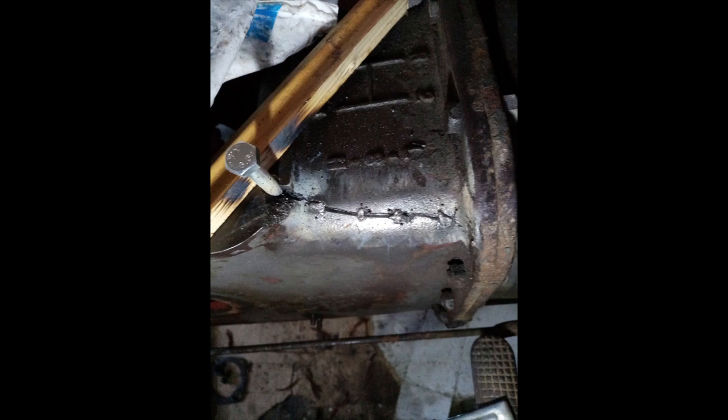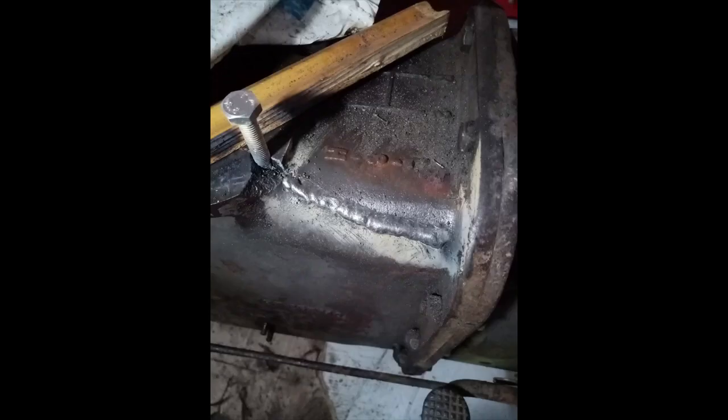But yeah, I preheated it up with the gas, and then I tacked it at the two ends and in the two middles, as even though it's a big solid back end, when it starts to get heat from the weld, it will start to shift shape on you, expand. So I locked it in with some tacks. Having my gas beside me, I also then kept the preheating before I went in at it. Didn't want to lose any heat, so then I started to go at it with the MIG welder bit by bit.